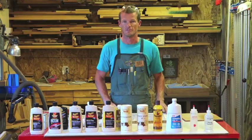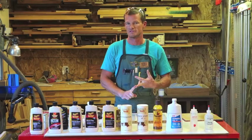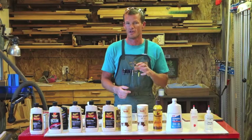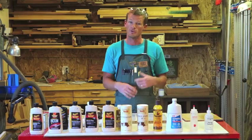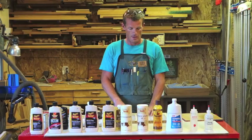The purpose of a rub-out is to remove any type of brush stroke, any streakiness in your finish, any dust, any bubbles, any type of debris that got onto your top coat after application. A lot of you came up to show me your shellac board because of all the streakiness, and I told you don't worry about it — when we do the rub-outs, all of that will be removed. I'm going to demonstrate that for you in just a few moments.